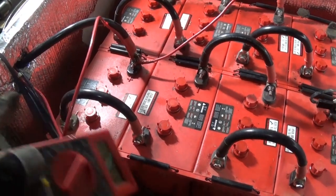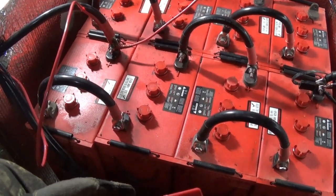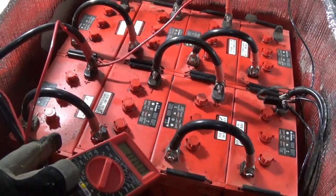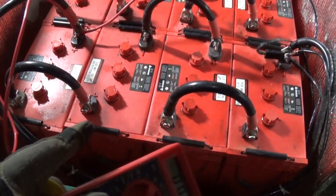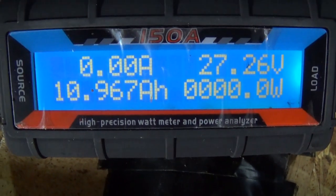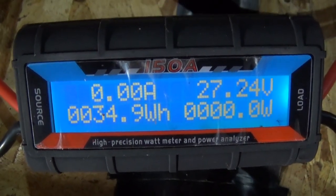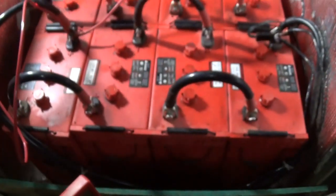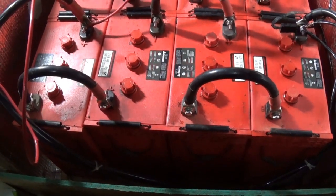Here's what I found: 6.3, 6.3, 4.0, 6.3. Now these I had already wired up and I'm using them, so when I did them they were all above 7 because they were charging. Now I've got the power turned off and I'm checking again. Before I initially started charging and put a load on, the initial reading was 26.1. Right now that grouping is 27, and it looks like it's slowly going down - 24, 23 - so it's resting.